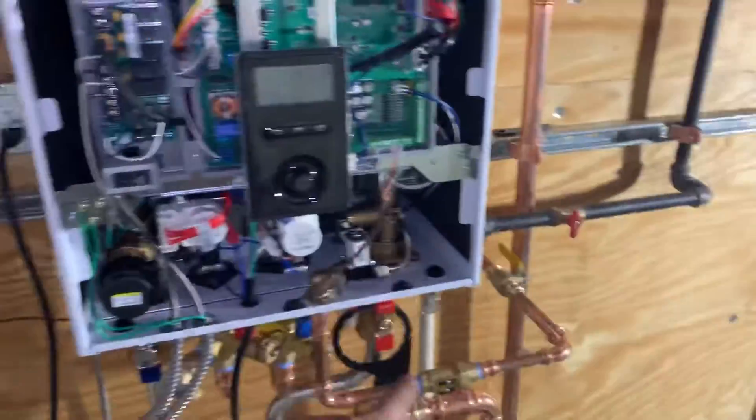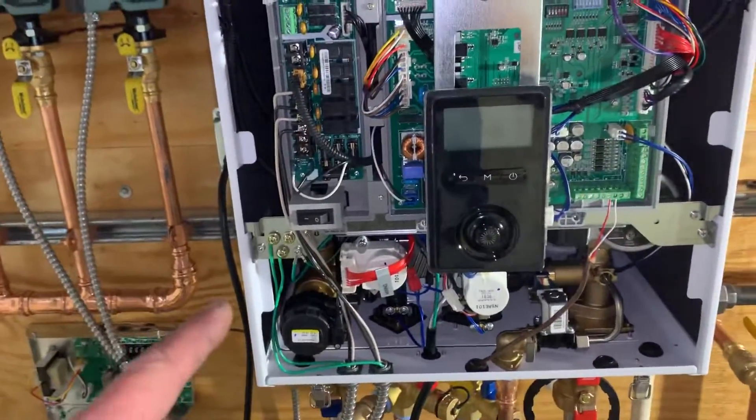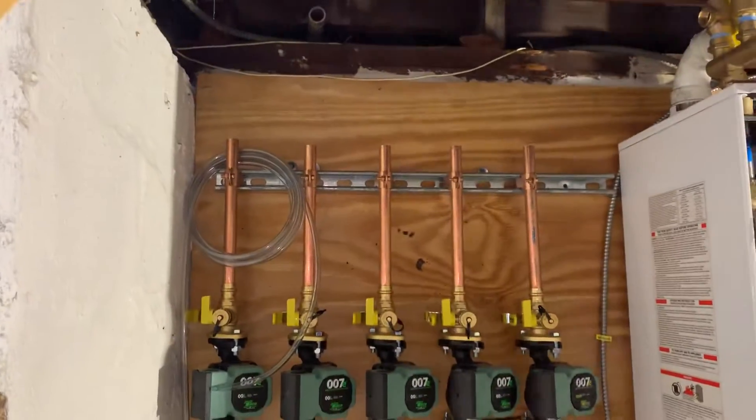You can't use all three zones and look for another TT — it's not going to happen. You need to use one of the zones to hook up a third-party zone panel. This house is under construction, so they're going to put some radiant in.